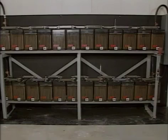As the cells discharge, sulfation occurs. The resulting sulfate crystals can be difficult to remove with normal charging and can prevent the cells from taking a full charge. For this reason, a freshening charge is typically applied to wet charged cells before they're put into service.